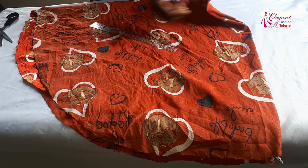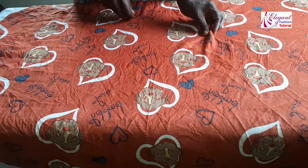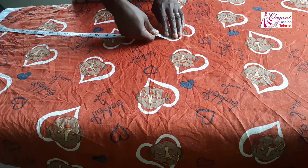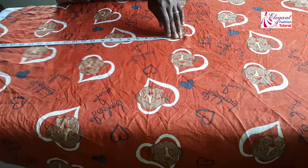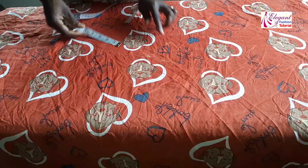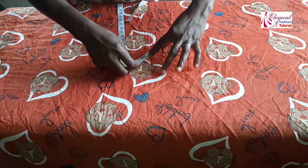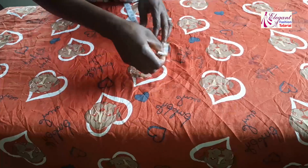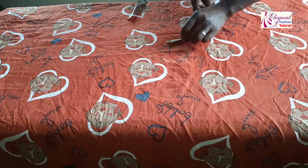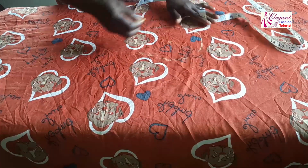this is the center, which is the tip. I'll open it up. You can see this is the dot. Then from this point, I'll fold it. I'll check the side that has 24 inches of length, which is this side. It is 24 inches after the radius. If I remove the radius from this point, I'll take the 3.5 round. I'll take it round from the center. I'll join the lines together to make a circle.